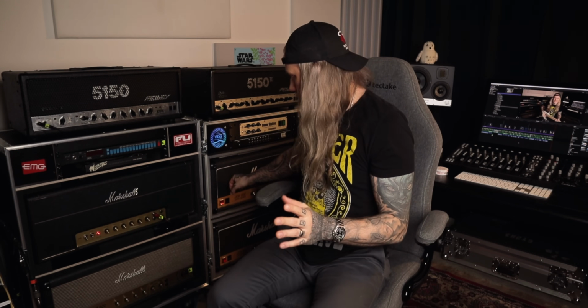And now, if I want, I can blend in more bottom or jumper the channels to add even more bottom. So now the amp is just a bit more versatile. It still cleans nicely when you roll down the guitar's volume. And now it is the Plexi sound in my head, because in general the sound in my head has been my first tube amp ever, which I bought in the 90s, a Marshall JCM800. And now I have the Plexi sound I had in my head, it's here.